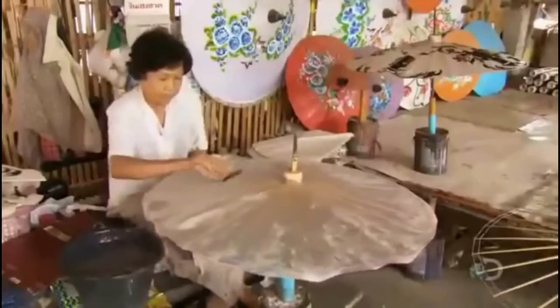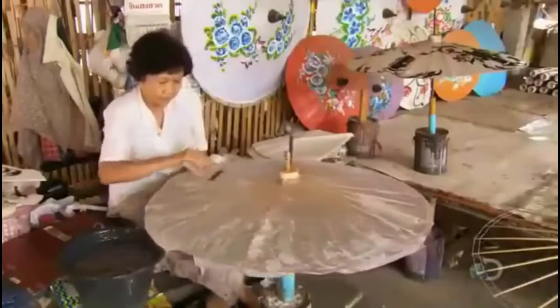They cut the sheets to the shapes required, then saturate each piece with glue made from cassava, a tropical root vegetable. After applying a circular piece around the hub, they glue pie-shaped pieces onto the rest of the frame. Once they cover the entire frame, they repeat the process to add a second layer. They fold all the pie-shaped pieces over the end to thicken and thereby reinforce the edge of the umbrella.